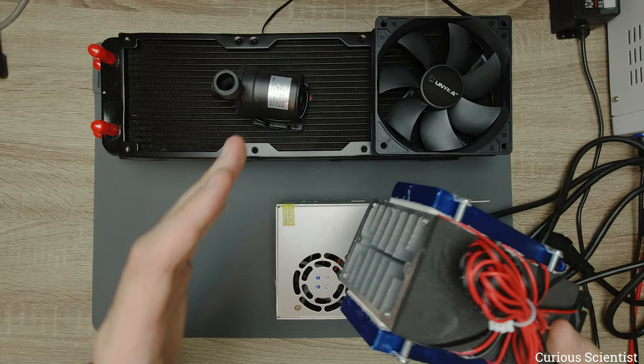After letting the system run for a while with no fan: the water temperature is now 31°C, the room temperature (green probe) is still 26°C, and the heatsink has dropped to minus 12°C — I can see ice on the exposed parts of it. The fourth probe reads 27°C, just the room temperature. Now comes the interesting part: I'll start the fan and introduce heat to the system.